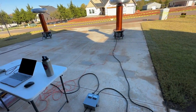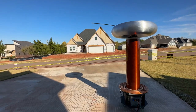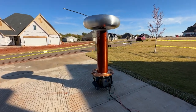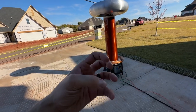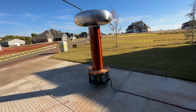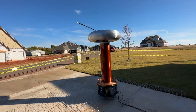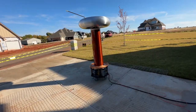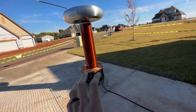Another question I get asked a lot is: how does the Tesla coil actually make music? The cool thing about a Tesla coil is when you make these big arcs of plasma, they essentially break down the air from a gas and turn it into a plasma. The process of converting a gas to a plasma is a very violent process that involves a lot of energy. After it's done, the air actually expands due to the heat generated when it forms a plasma. That displacement of air generates a pressure wave that we can hear. It's a pretty substantial pressure wave because the arc itself is quite large — anywhere between 10 to 12 feet, sometimes bigger, and it can be upwards of a couple inches in diameter.